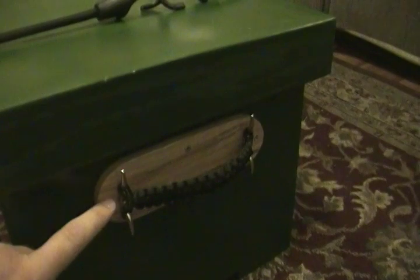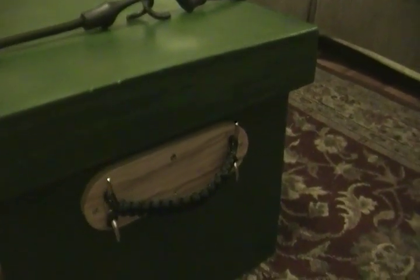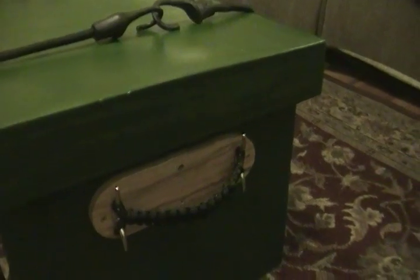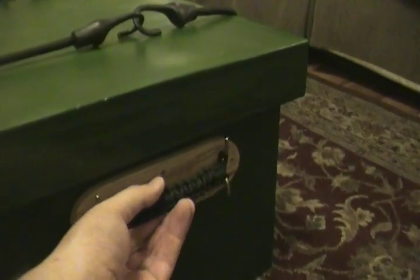For the handles I made these little oak plates because I wanted something that I could get enough screws into to get a really firm purchase, but it didn't go all the way through because I didn't want to create a penetration through the side of the box. Then I put these little nautical type anchors, and then I used some 550 cord to make a cobra stitch — like people often do for bracelets — to use as a handle so that it can come out nice and flush and makes a nice strong handle.